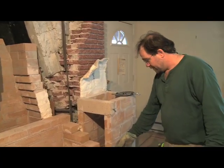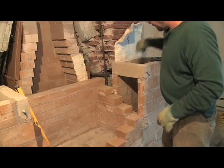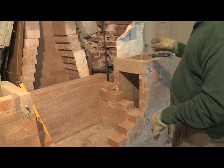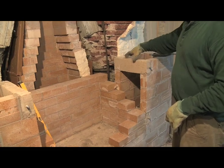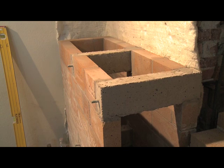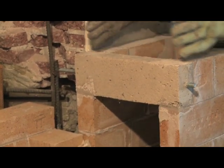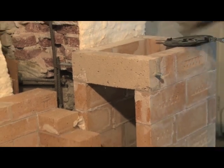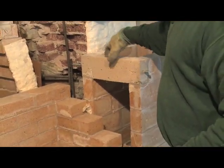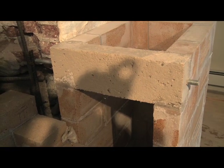Come up, I believe, about three or four courses here in the bells of the heater. A special feature here is that we have these cast, we've been calling them cross ties, and these are to stabilize the walls of these bells for seismic forces. And these cross ties are actually castable refractory, and they have threaded rod inserted through them, and it's just a low carbon rod.